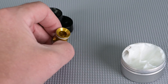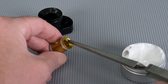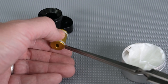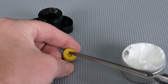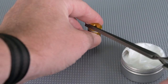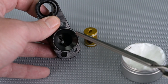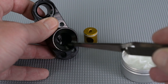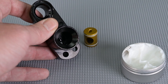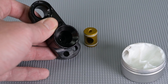Next, inspect the valve face surface, taking a look at the edge. We don't want to see any debris, nicks, or other damage in this conical area. The two O-rings on either side need to be the correct size, clean, and undamaged. You'll notice a slot on the back of the breech block divider — that slot aligns inside the breech block to keep orientation correct. Looking down, you can see the male component of that engagement surface. When you go to install this component, it will prevent installing it left or right — it will only allow installation up or down.